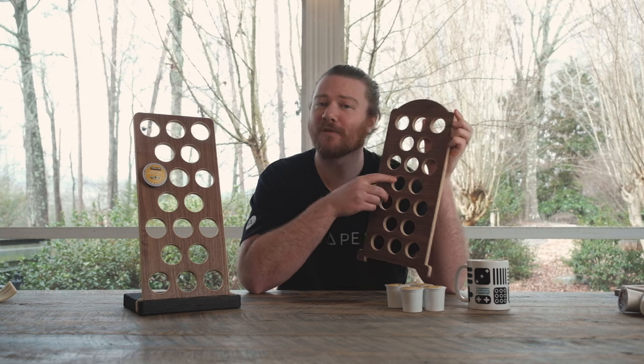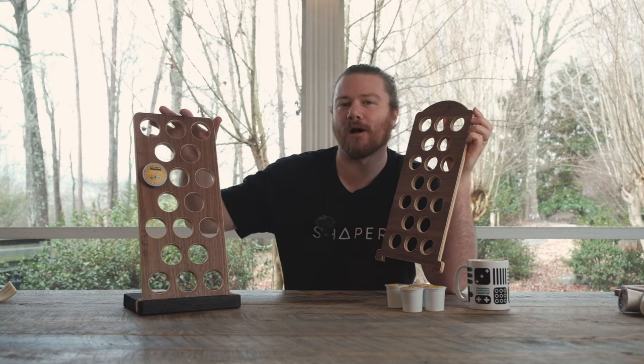Now, if you're wondering how that happens, it's because Hamilton transposes numbers very easily, which is not great for the profession that I have chosen. So instead of making these holes the correct size, which was 1.875, I believe, something close to that. No, it's 1.6875. That's what they're supposed to be. I had made them 1.4 something. I sent those numbers to Mitz. He did what I asked. It was too small.